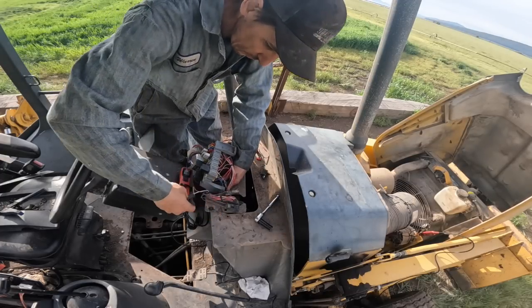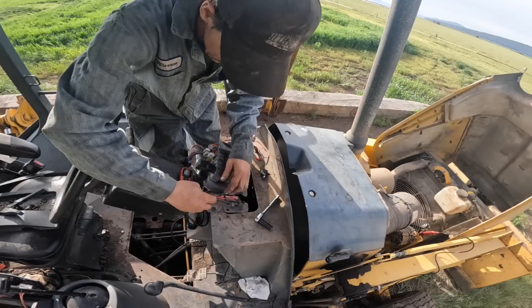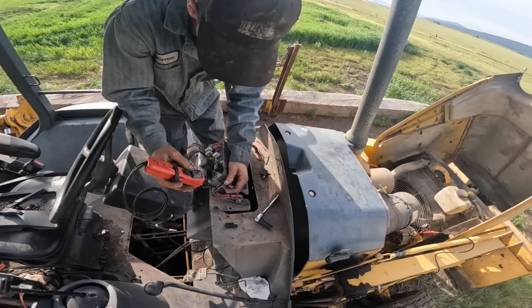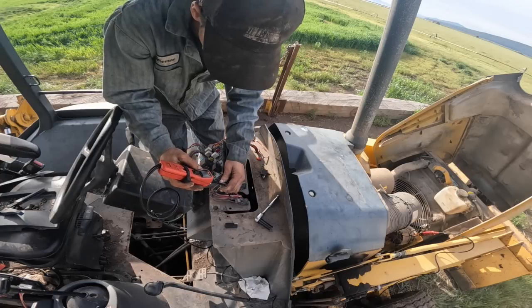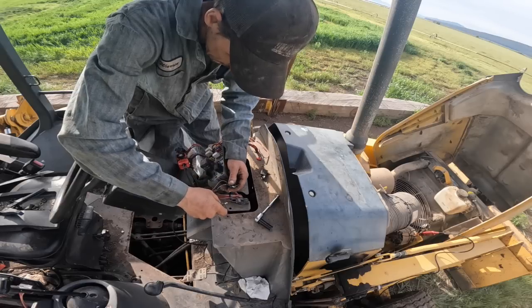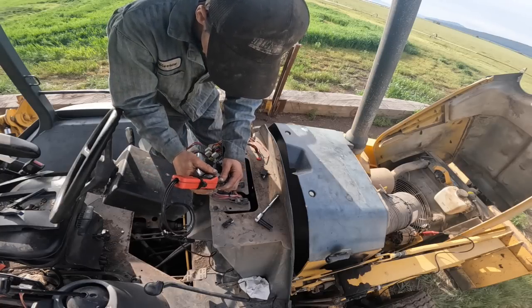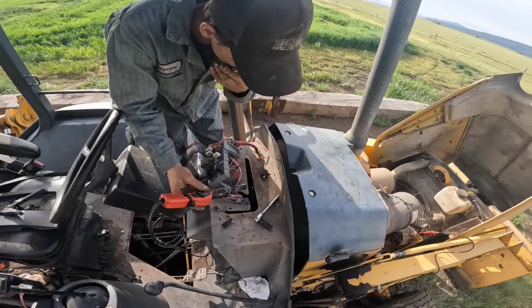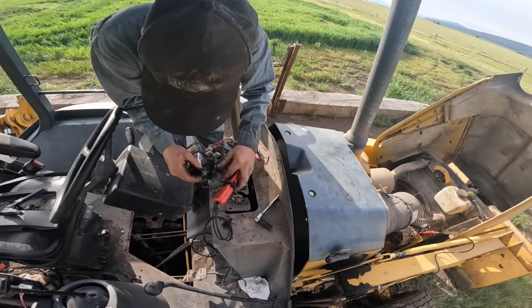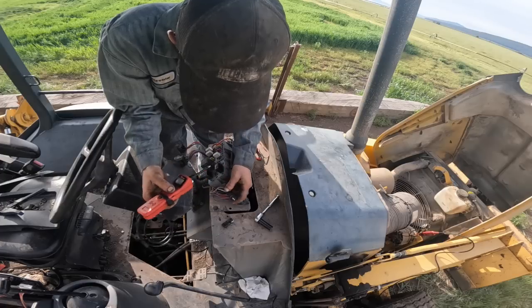So, where the wire comes through the diode, we're not getting to ground. But we got a ground there. Why don't we have, if the diode's working the way it's supposed to, why do we not have a ground? Get out of here, you son of a bitch, go away. I'm not understanding this. I really ain't. Which one do we got the ground on? We got the ground on that one. We don't have a ground coming through this. God, is this plug bad or something?